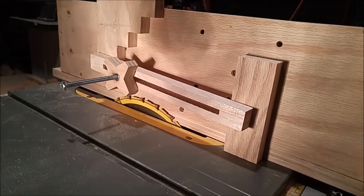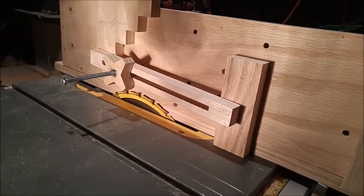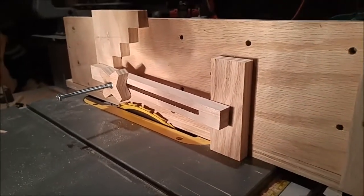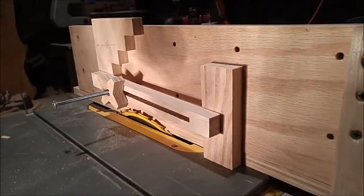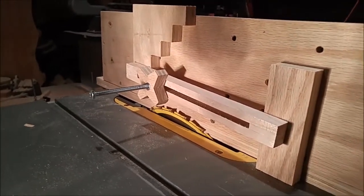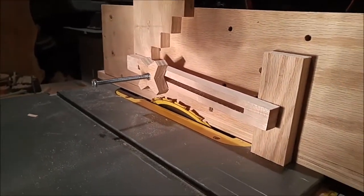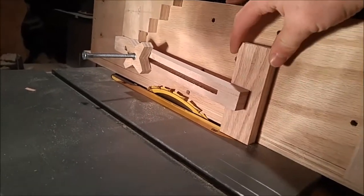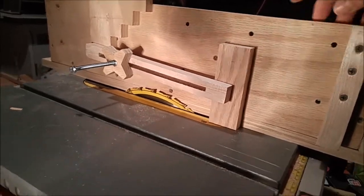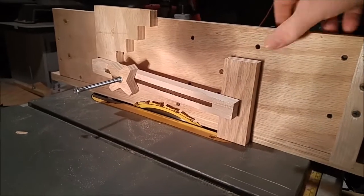That's the cut I ultimately wanted to make with this jig, which I'll show you next. I'm not going to cut this — this is just to show what this looks like. You could change this angle to whatever you want, like 25 degrees, change it to whatever bevel angle you want. Then you lock it down and run the piece through. This is held in place pretty well. You could add more clamps — I just have one here, but that's usually enough.